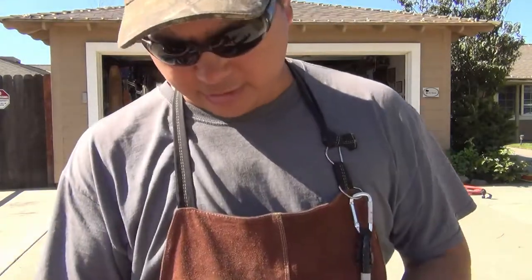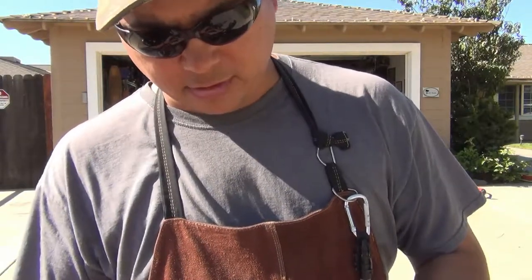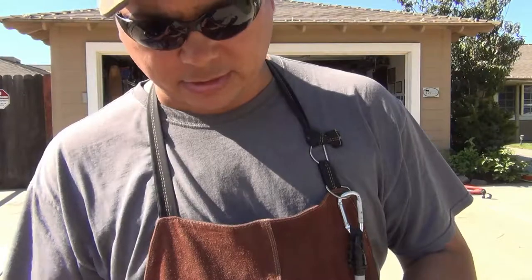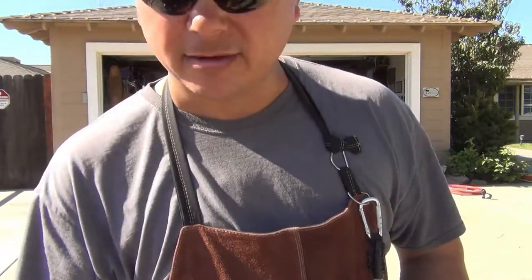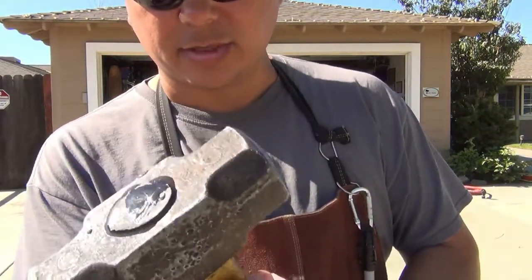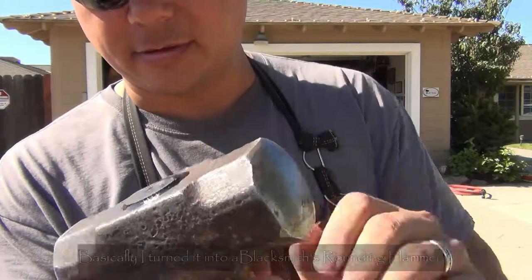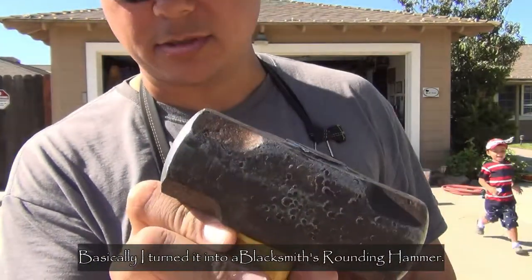So I tried fixing the hammer yesterday, just after I shut the forge off. Just filled it full of epoxy and put that, looks like it was a cap, back in there. You can see it there. The reason why I like this one is I ended up rounding it off. Just a little better for moving that metal, especially when I stretch it out a little bit.